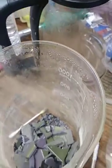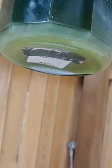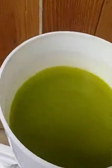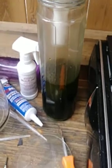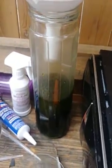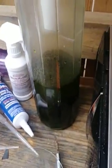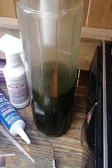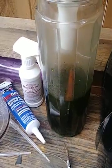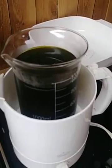The rest I've picked through and messed with the silicon and it's all dissolved. What I noticed - which sucks because this is taking forever to filter - is I still have that yellow gunky mess that's gotten through even my good filter. So the next step to get this as clean as I can is to filter once again, using a Charmin plug. It'll take quite a bit of time but once done it'll be a clean solution. I'm going to denox it, then filter it to get out any other solids with the Charmin plug, and then we'll be ready to drop gold.